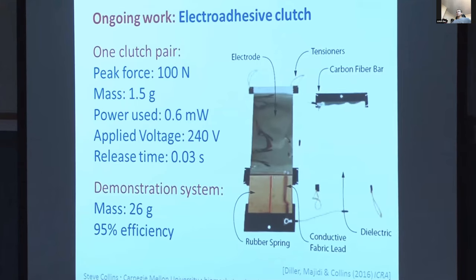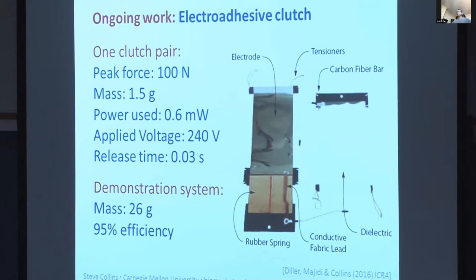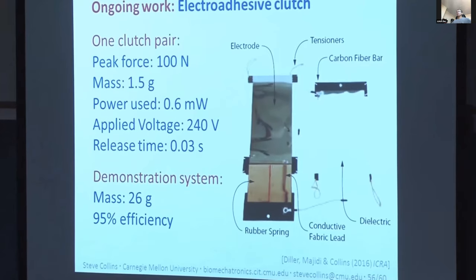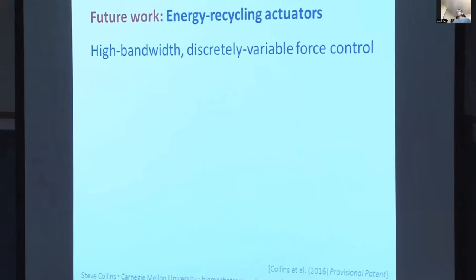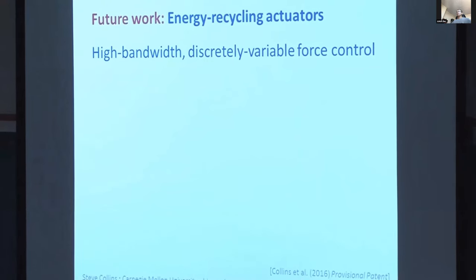And this is especially beneficial in tasks like walking, where if you're going at steady speed on a level surface, there's no energy input required. The mechanical energy of the system isn't changing over time, right? So the ability to capture energy in a controlled way and then return it in a controlled way could be really helpful. The problem is that CVTs for robotics are terrible, right? They're heavy, they're big, they're bulky, they're lossy, they don't like to shift at zero speed.